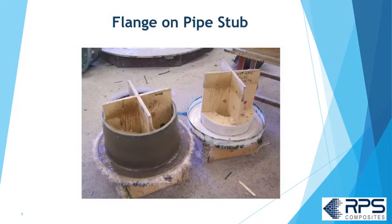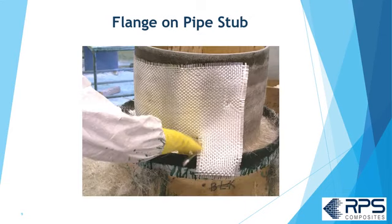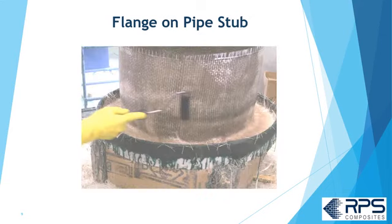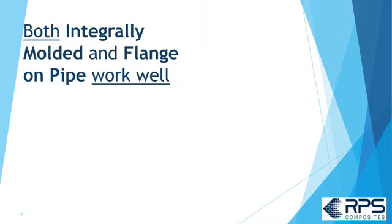A flange on pipe stub is a little different. First, I slide a tapered piece of pipe down over my flange mold. I apply the liner material up and onto the tapered pipe stub. In this case, it's an abrasion-resistant liner. That's why it's green. You apply the structural layers, you roll it out, and you have a flange on pipe stub. Note the top of the flange is actually the original pipe stub I slid down over the mold.